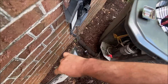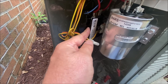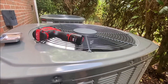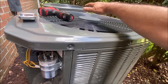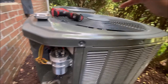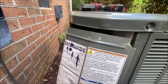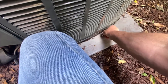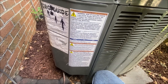I did a little test run when I had that other harness. The contactor's in. I hear it buzzing. And there we go — compressor and fan are running. Here comes the warm air. It's already starting to pull heat. I called inside to the customer and asked her to go turn the thermostat back on, which she did. And we are almost out of here.